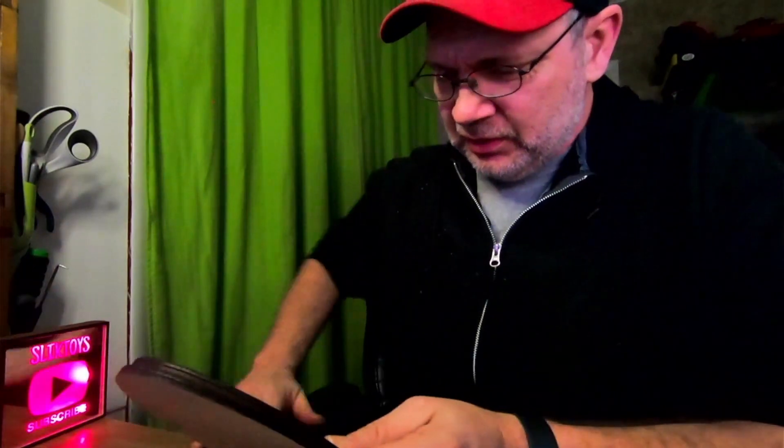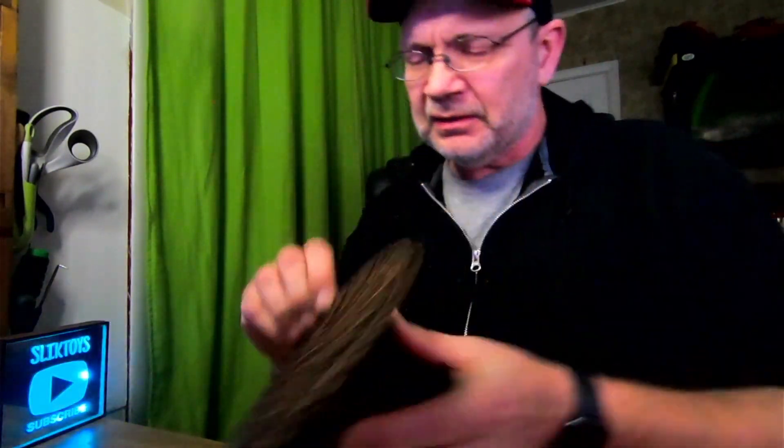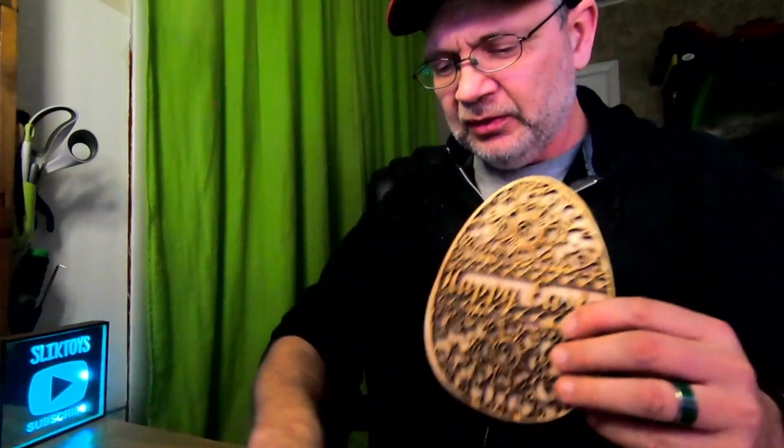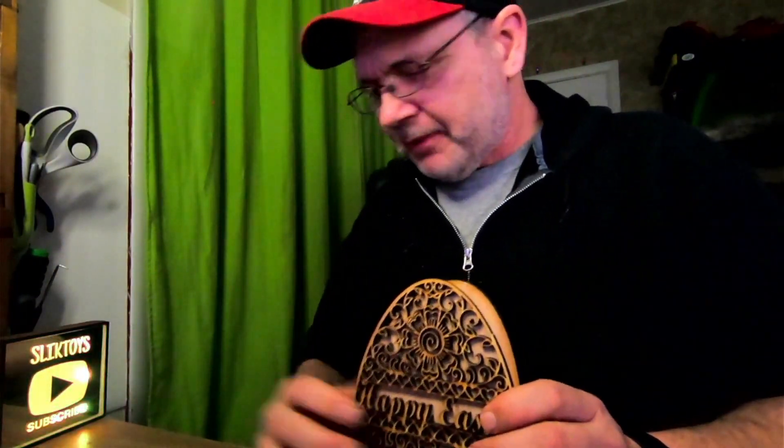I'm using non-proof grade material, and sometimes it's a little warped — in this case it was. You could just leave it just like that and it would be nice. But when material is warped and you set your focus, it doesn't exactly get it right. Where I set my focus was a different height than the camera wanted, and so it cut a little off. On non-proof grade materials from now on I'm not going to get that close to the edge. However, we're okay — I'm going to go ahead and cut another one, paint them up, and I'll get right back to you.